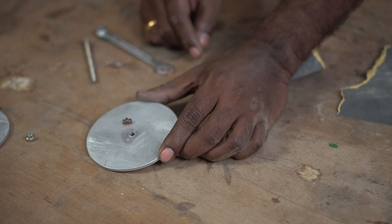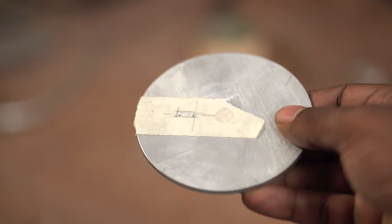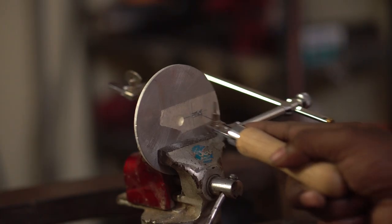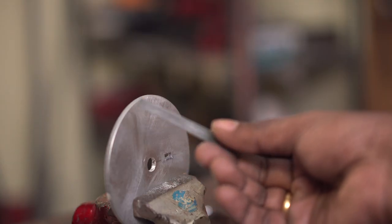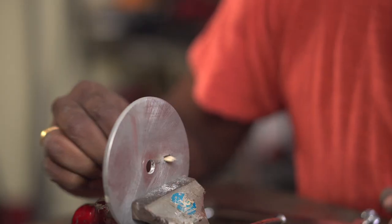That switch is really small, so I have to be super precise while drilling the hole. Using masking tape, the switch placement was marked and I made 1mm holes for the coping saw blade. Then with ultimate care and patience, a square hole was made for the switch. I don't have files to fit this size — so sticking sandpaper on popsicle sticks makes it work like a small file.